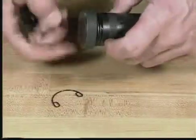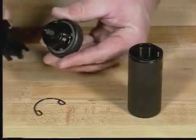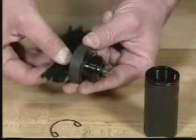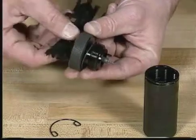To clean the gas release knob, remove the retaining spring and remove the knob. With the cleaning tool positioned as shown, rotate the tool until the counterbore is clean. Turn the cleaning tool rod out as shown and remove any carbon deposits from the gas portholes.